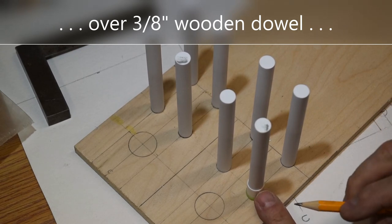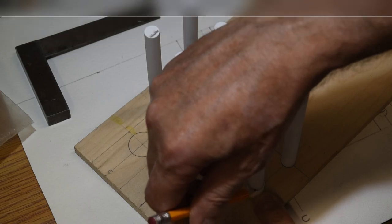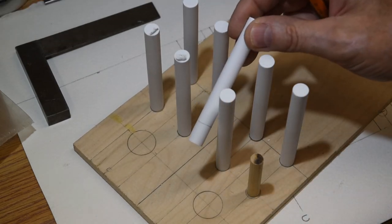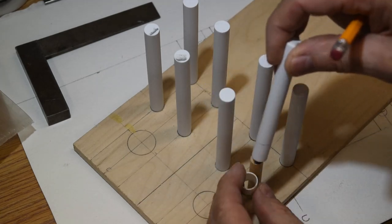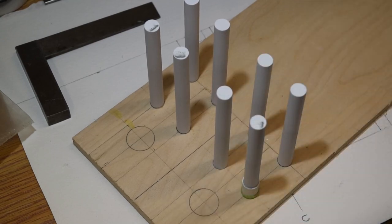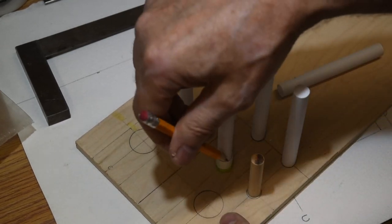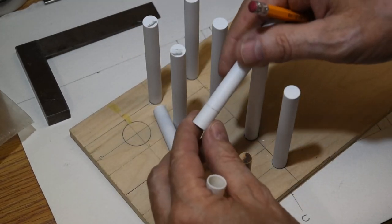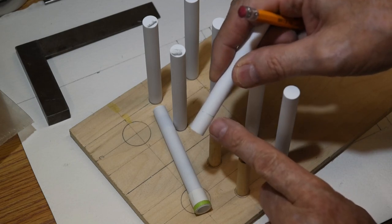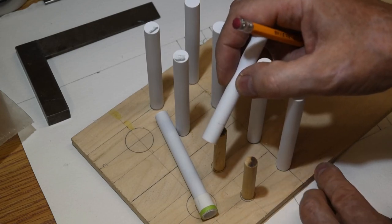So I just slide that collar on there and then I can make a pencil line on every one of these poles with this spacer, flat down on the surface of this jig, see? And then I just move it to the next one. Draw a line and I'll get a consistent line exactly the same on all four poles. Totally square as well. Here's from another angle.